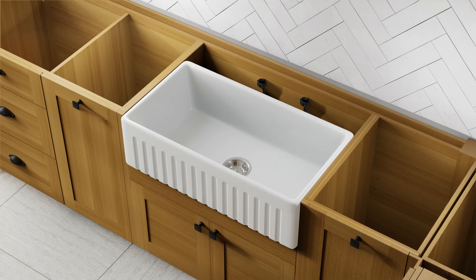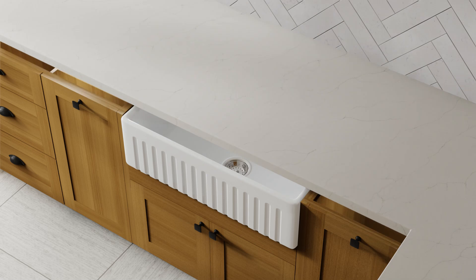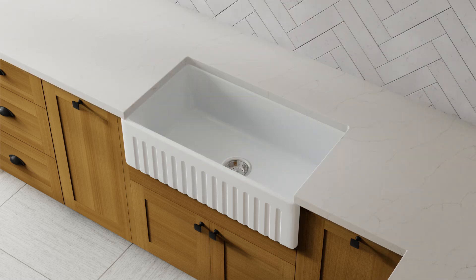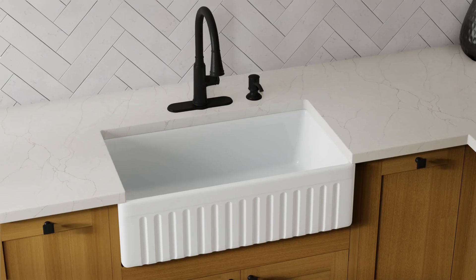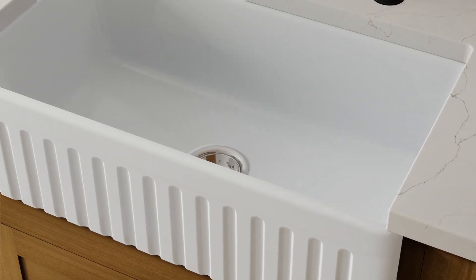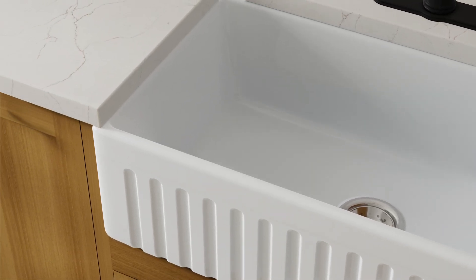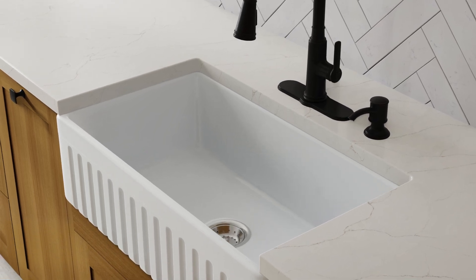Step 4. Due to the variation of natural material, no cutout template is included in the box. You'll need to carefully measure the countertop to determine the precise location of the cutout and mark it with care. The sink can be positioned to extend slightly above the top of the countertop during installation, resulting in a lip around the sink's edge, which should be sealed with sealant to establish a waterproof barrier. MSI recommends providing the cabinet maker with the actual sink prior to cabinet fabrication. It is further recommended that the installers discuss this with the customer and agree that this finished appearance is the desired effect. Install the countertop as recommended by the respective manufacturer, following requirements for sealant between the cabinet and the sink.